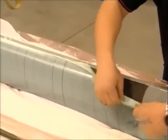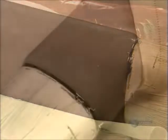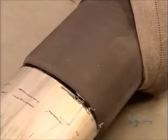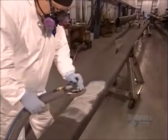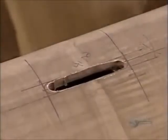Back to the mast — they pull the big aluminum mold out of the mast tube. Using a disk sander, they rough up the surface so paint will stick. They drill two holes, and using a jigsaw with a special blade, they connect them, making one wide slot.